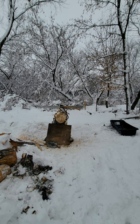It's cutting pretty good. I'm getting a couple hang-ups, so I think I might have a high raker here somewhere, or one or two teeth that are out of set. I need to look into a little bit more crosscut sawing to look at the kerf and see what the kerf is telling me. I'm getting some good noodles, so I think I have my raker height generally set pretty good. The hang-ups also might be from me rocking the saw and catching an edge in there.